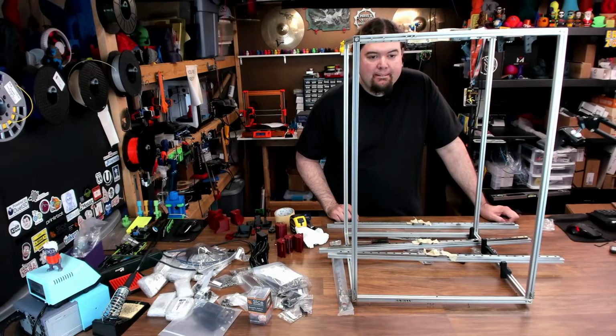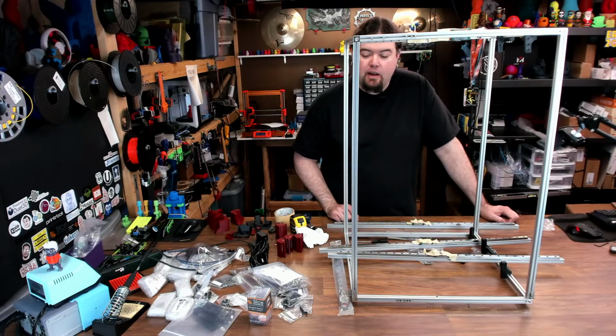With a good brand of PVA? No. All the PVA that I've ever had has been pretty much the same. So I just try to find the cheapest one. And I still really don't have a lot of luck with it unless it's actively being dried. So a lot of times I'll just get Inland brand and just keep it in the dryer and print it from there. That's about the only way I have success using it.